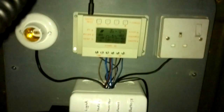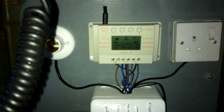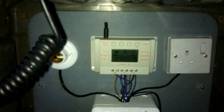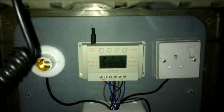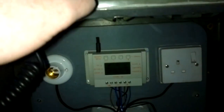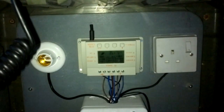Need to sort out the SWR. Battery's gone down from 12.4 to 12.3, then 12.0 when I transmit. Drawing 0.03 amps on receive; when I key up it's drawing 2.4 amps, which is good because that's a 10 amp charge controller. I'm actually running the radio from the charge controller at the moment - it's a better controller than the small go box, which wouldn't let me run the radio from it.